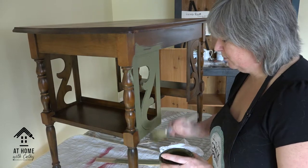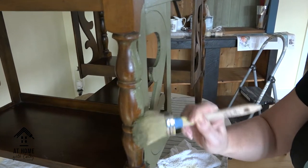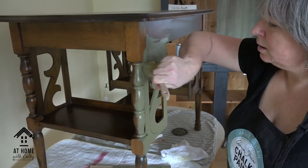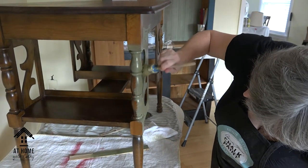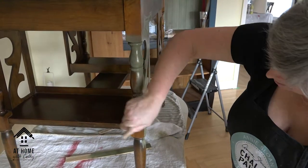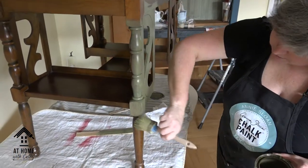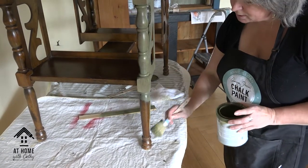It's going to be a little painful to paint these round things — I have to wiggle the brush all the way in between where the spindle meets the decorative side. I find it easier to paint spindles by using my brush all the way around them and making sure I get underneath. I can't get a perfectly smooth finish here, so I'm keeping my brushstrokes all going one way. From the color I can tell it will take two coats — the wood underneath appears to have a walnut stain.